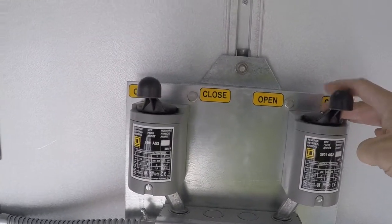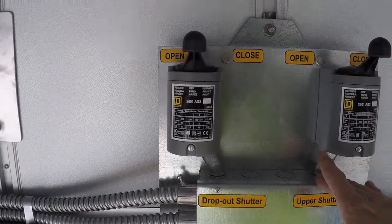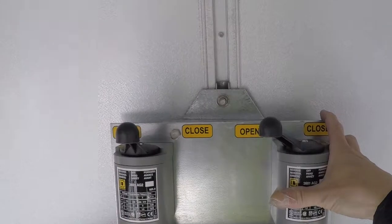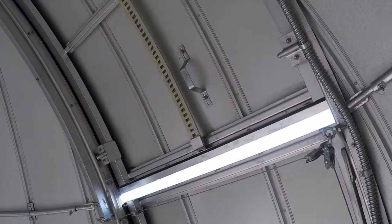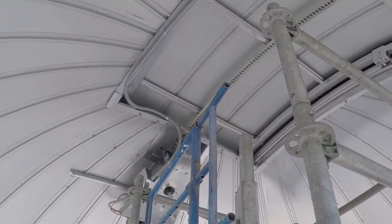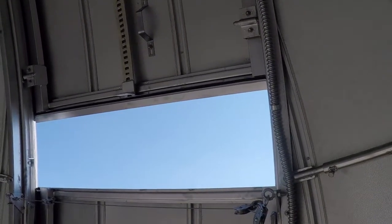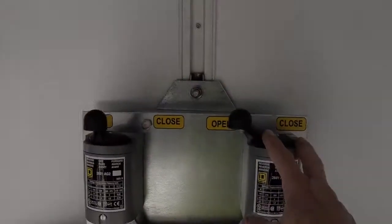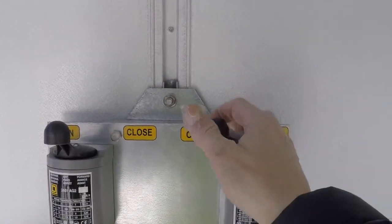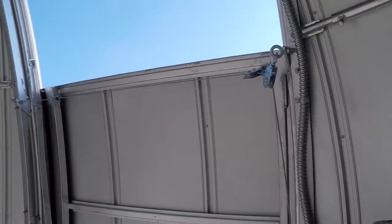Now I'm at the level to open or operate the shutters. There's the upper shutter and the lower shutter, and it's labeled both to open and to close on either side. If you're going to open the shutters manually, you need to open the upper first, at least to a position — so if I flip this to open, you can see we're opening up. I'll let this open for a bit to show you the lower shutter and how limit switches work. If I leave this, it'll go until it's fully open and then the limit switch will trip and stop movement even if this is still pointed to open. I'll flip it back to center and we'll stop movement.